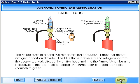The halide torch is a sensitive refrigerant leak detector. It does not detect nitrogen or carbon dioxide. The blue flame draws air and refrigerant from the suspected leak site up the sniffer hose and into the flame. When burning refrigerant in the presence of copper, the flame color changes from blue to green.